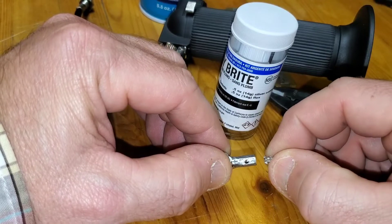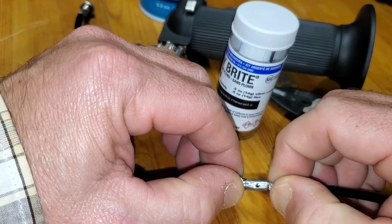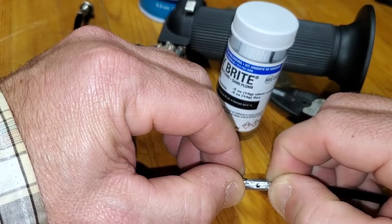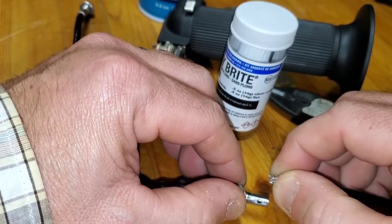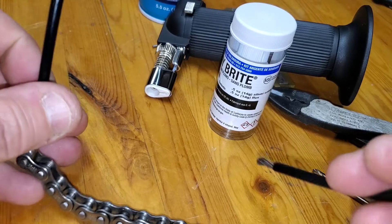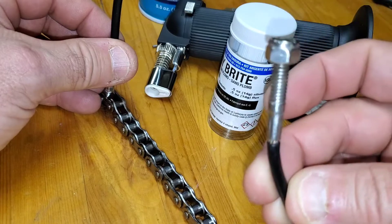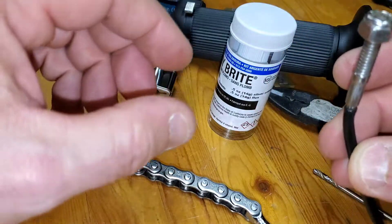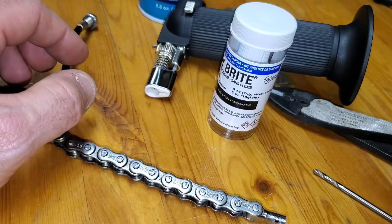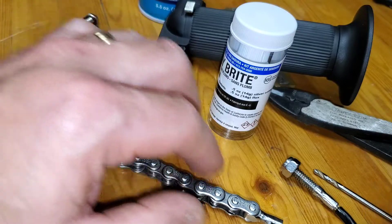You really have to hold and pinch on the braided cable to insert it into the ferrule and also twist at the same time so you don't get any of those cable wires bent back - but it will go in there. The key is, once you get it set in there, you want it at the same attitude - see the bend going around the drum - so you don't want it at a different attitude, otherwise you're going to stress-relax it in a different direction and put additional stress on the cable.